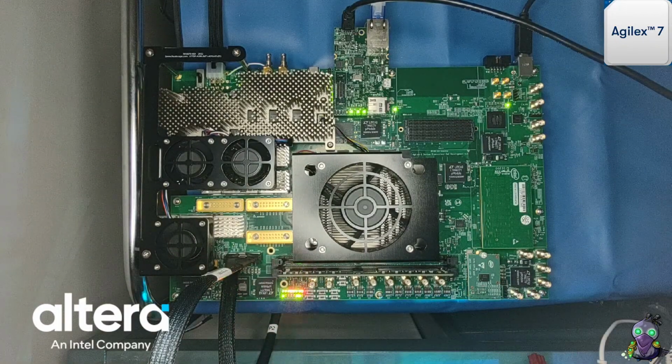Okay. Name it Nios V top. Make sure the name has an underscore. Once we get this going, I'll show you where the user guide is. We're going to do Agilex 7. Go ahead and finish. Then we're going to go up to devices and change those configuration pins.